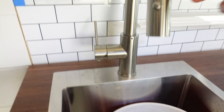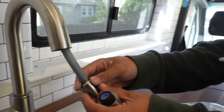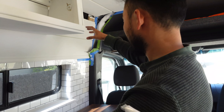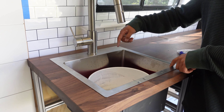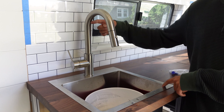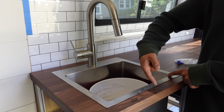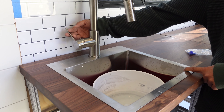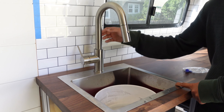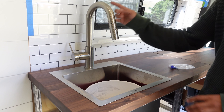This heavy thing that you see dangling up here is basically how the sink retracts. We had to get one where we can unscrew it, so it'll unscrew there. We'll attach our shower to this, which will let us shower right over there. We'll close it over here and have the shower head right there. This sink is 13 inches by 11 inches. When you're buying a faucet for the sink you have to make sure the faucet is small enough — initially we bought one that was a little bigger and it was angling out, so it would have shot water out past the sink. So be conscious of that. We'll leave links in the description below for both the sink and the faucet.